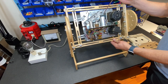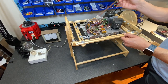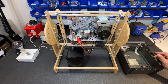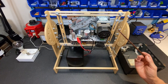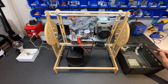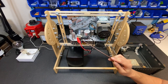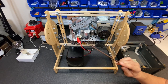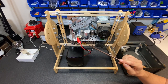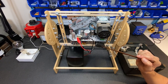I did order some belts that supposedly fit this unit, so while I wait for those to arrive I'm going to start working on the electronics restoration. Before replacing parts, let's do a quick test to see if the tape player is actually putting out sound. I connected the unit's speaker to the output transformer and heard no sound, not even a buzz. The speaker's voice coil checks out on the ohmmeter, and I also connected a Minimus 7 to the unit and got the same results. The output transformer could be bad, there could be a fault in the circuit, or more likely one of the tubes is bad. Let's also make sure that the power transformer is working and the circuits are getting power — the AC motor is likely connected directly to the input power, so it'll run even if the power transformer is not functioning correctly.